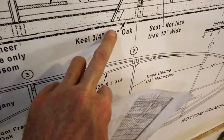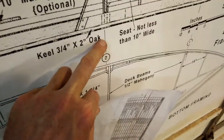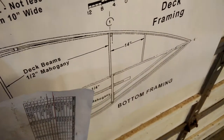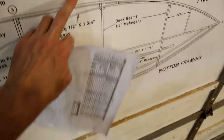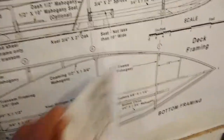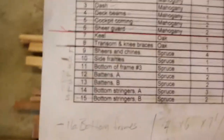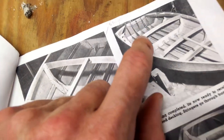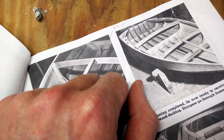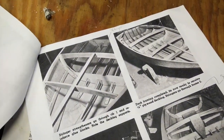The keel is oak, as are the transom and knee braces. I haven't done anything with them yet. I may do the keel out of oak — it'll need to be glued up and I can get that locally — or possibly walnut. The keel is really the bottom batten; there are spruce battens on either side. For numbers seven and eight, the transom and knee braces refer to gusset pieces in the back. The author says they should be bolted through, but I need to do more research on exactly how those are configured.